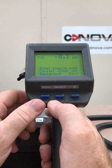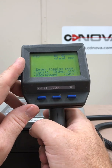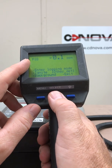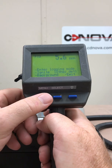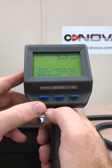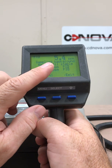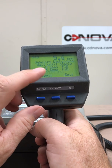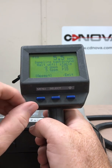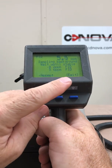I can press menu again and go to 'other detector.' I'm on the FID now — you see it change. If I press select again it'll go back to PID; press again and it goes to FID. Going to menu again and I'm now on 'background.' I press select and this screen says 'sampling background — wait until stable.' It's taking a background reading in ambient air and will zero that out. If I hit accept it'll zero this out, creating a zero offset of 5.5. If I don't want to do that, I press menu over to exit.